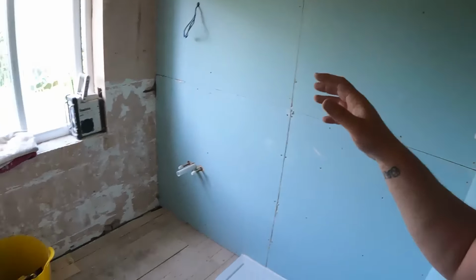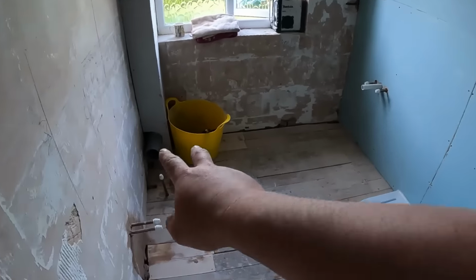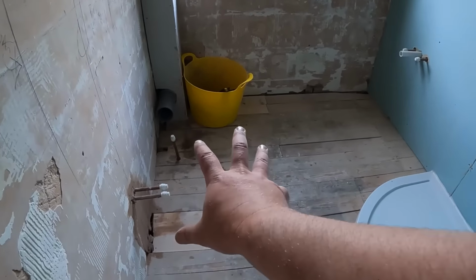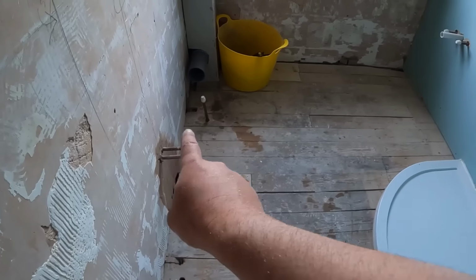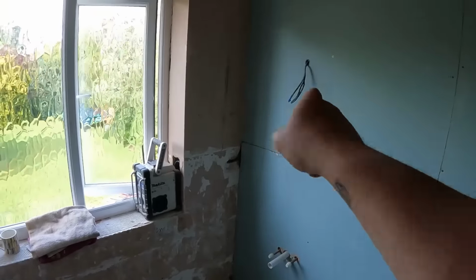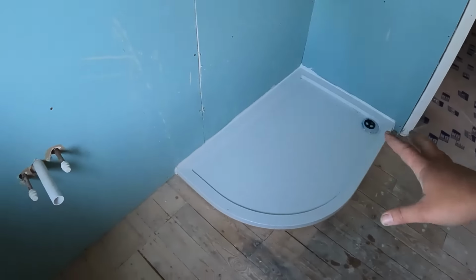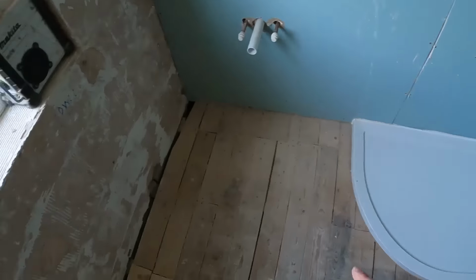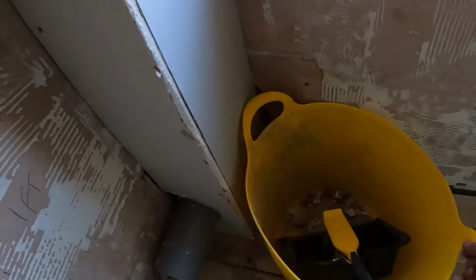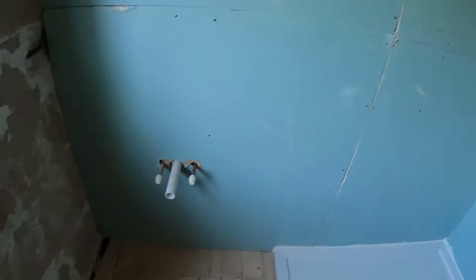So there we go, week one done on this bathroom. So just a quick overview, we've obviously took out the existing bathroom that was in there. We altered the pipes under the floor to bring everything out in its new position. Towel there, toilet going in there, basin on this wall, got the electrics in there, shaver point, got rid of the old electrics, took the old shower out, got the new one in, low level, altered the waste pipes under the floor. Remember, we altered that soil pipe, and remember there was that box in there, we've managed to get rid of that, which is great.